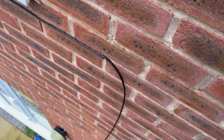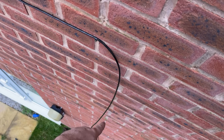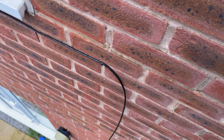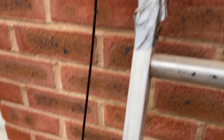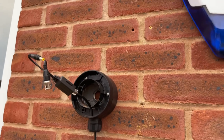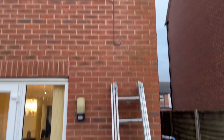Cable down, meet up and marry up with this cable, follow it straight down to the entry point, and do a water loop or drip loop. Then we can be inside — it's so windy and cold out here. That's the second camera now mounted and fixed. Put the camera on, cable clip it down, and we're nearly there.